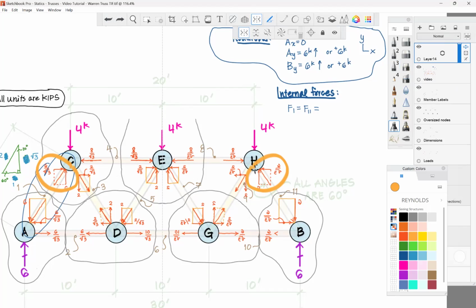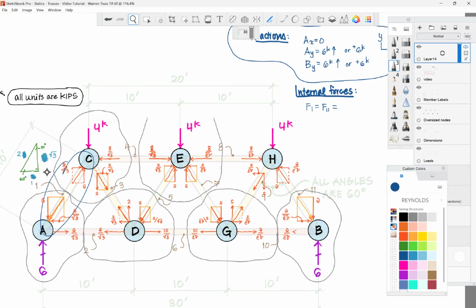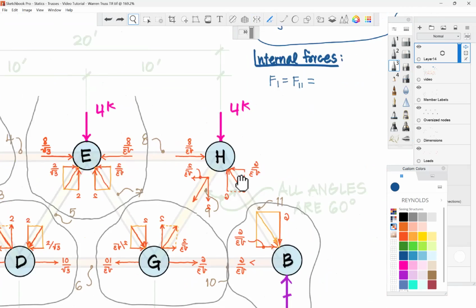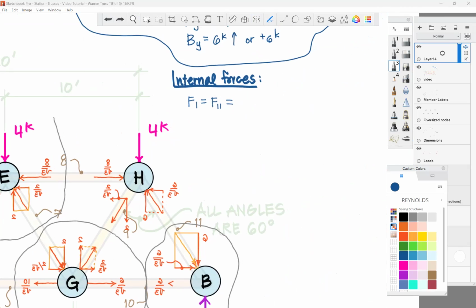And what we see is a push force. We know it's going to be compressive. And at this point, we can go back to our triangle. So we could either use ratios to get the hypotenuse here, right? I could find the short leg and then double it to get the hypotenuse. That would give me the resultant force. Or I can use the Pythagorean theorem and just do the squares of the two pieces.